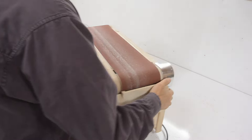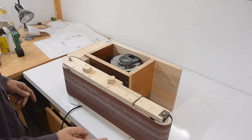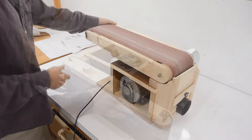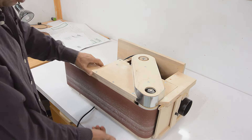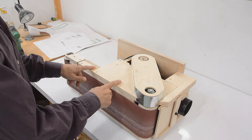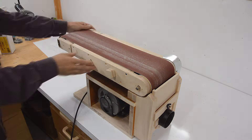My intention had been, when I want to use it as an edge belt sander, I'd flip it around. But the problem with that is now the belt is moving this way, which might be hard to get used to. So I figure a better method would be to just flip it down like this, but that puts the controls towards the bottom, so I want to move the controls on this side, because having the controls on the back while using it normally really isn't a problem.